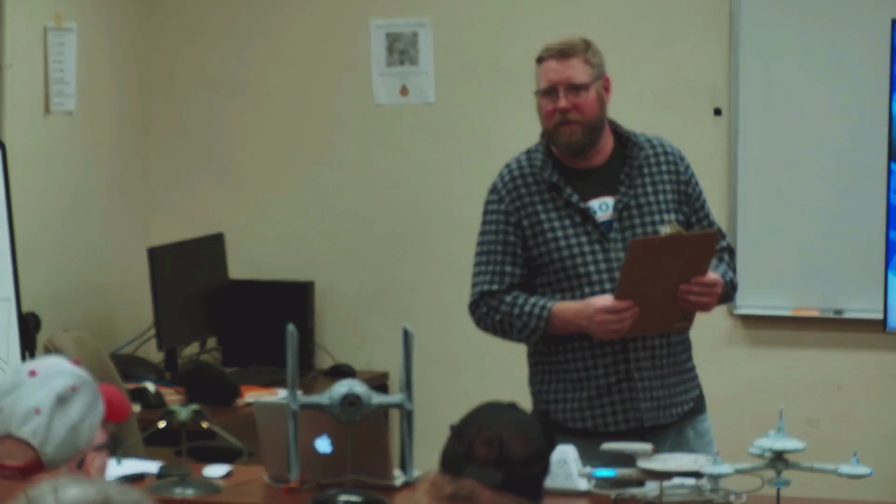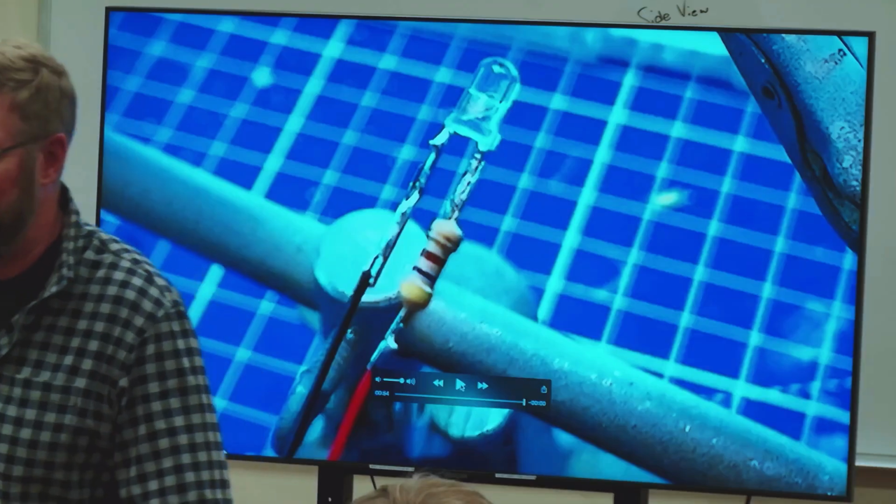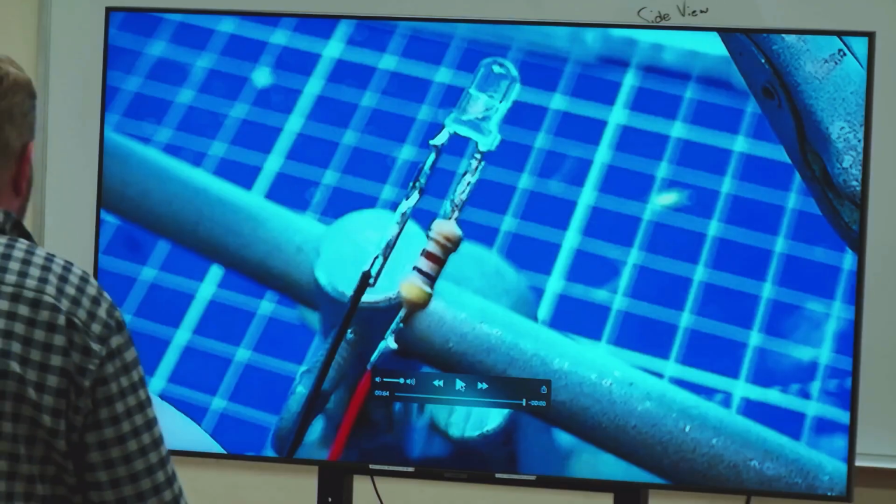Does it matter where in the length of the wire the resistor is? Could I put it at the bottom, closer to the power supply? Sorry, I apologize, I'm going to step over it. I actually don't hear so well. I'm working in really tight spaces. I do Gundams and stuff, so I've got to run wires through really tight areas. Could I put the resistors outside the model, closer to the power supply? Absolutely. Just as long as it is in line, somewhere between power source and light.